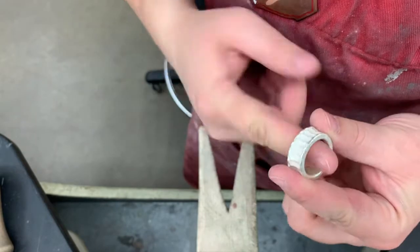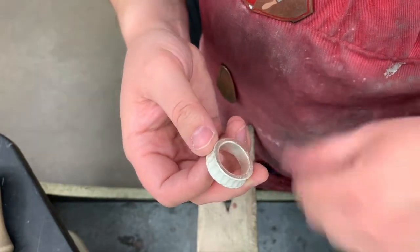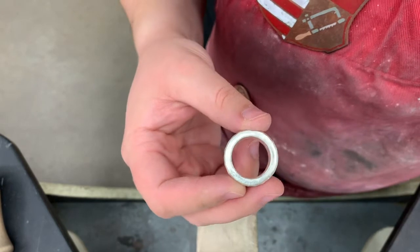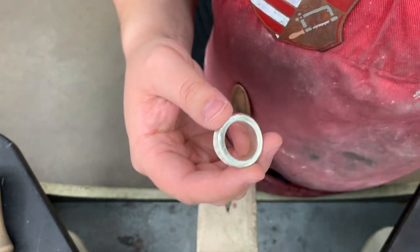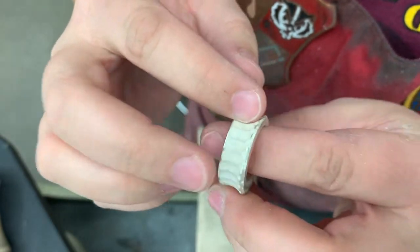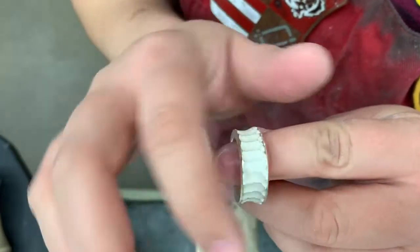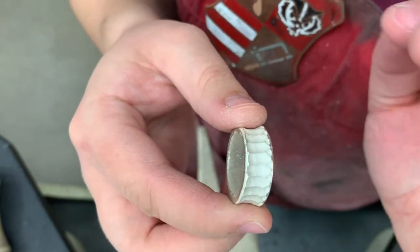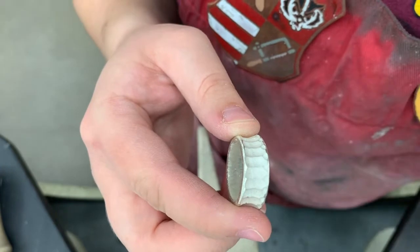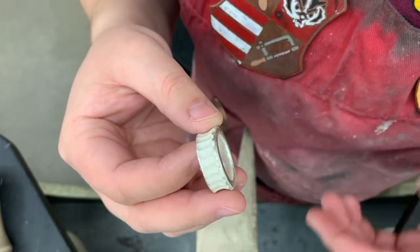So now the only thing I'm going to do is sand this. You can just use your sandpaper, wrap it around the inside and sand like that. If you've got a dowel at home, you could wrap sandpaper around there and then sand the inside or just do it by hand. I'm going to be taking this up to a 600 grit finish; you all can just go up to 400 because that's what I sent you. I have this texture in here — I didn't really file or sand that because that texture is really subtle and I don't want to file it out. I might just hit it very lightly with sandpaper because it would look nice if these ridges had a slight sanded or polished finish but these little divots in the texture were still that pickle white — a really nice contrast. Something to consider for those of you who have a lot of textured surfaces in your piece.